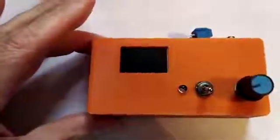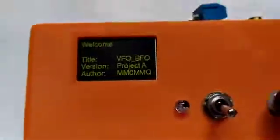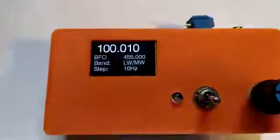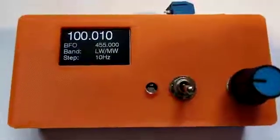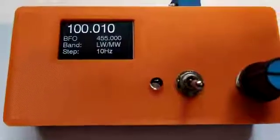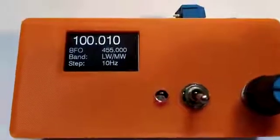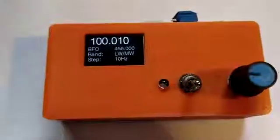The other thing, just to demonstrate quickly, is that there is actually an inbuilt battery. It's a rechargeable Li-Poly, and operation is identical. This particular development board that I'm using has very low consumption, but it's also got an integrated Li-Poly charger with a JST connector, so it's possible to buy one. I've got a 1000 milliamp hour Li-Poly battery in here, and it's charged every time the USB connection is made. And operation is certainly very, very efficient.